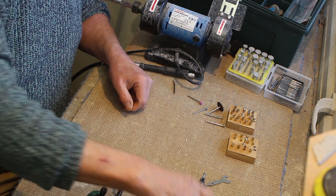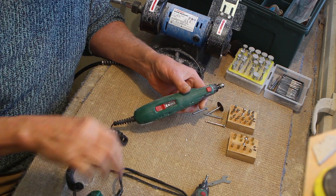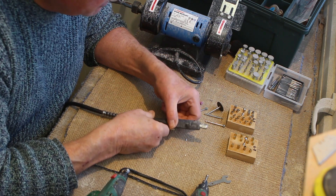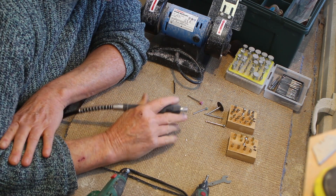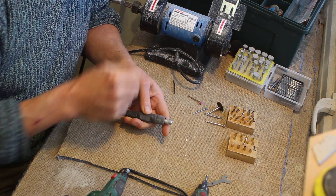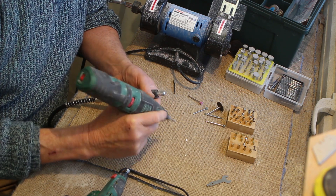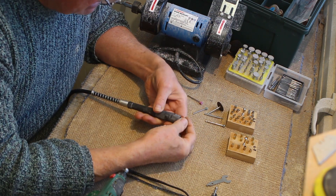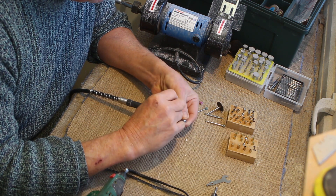That's the same system on my cordless grinder and on my corded 240-volt grinder - although it is 12 volt because it goes through a transformer. It's exactly the same system. On the flexible shaft it's got a slightly different setup because they want to make it as small and neat as possible - they don't have the button on the end. I do find the button is a bit of a pain because as you're working, you'll inadvertently click the button and hear a clattering sound, which is very irritating. This one doesn't have a button to hold the shaft, so to lock it you have to put a pin in that little hole. These machines are actually supplied with a pin.